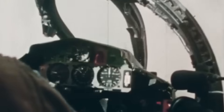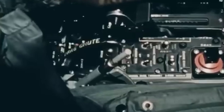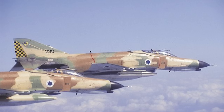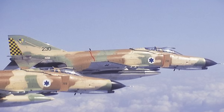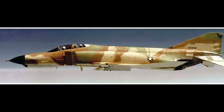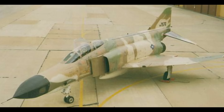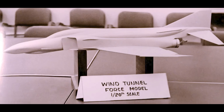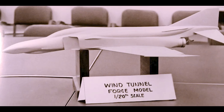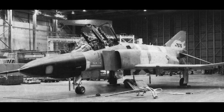With the State Department now reassured that the Peace Jack program wasn't going to turn into a high-performance interceptor, General Dynamics secured permission to test the RF-4X concept on an Israeli Phantom. An Israeli Air Force F-4E was flown to the General Dynamics Fort Worth plant in late 1974, where it underwent months of extensive testing and modifications. The program did, however, encounter some problems. After extensive experimentation, it was found that the water-methanol injection method would eventually cause the turbine compressor blades to expand due to increased heat, hit the casing of the engine, and tear it apart internally. To remedy this, designers would need more time to build and install stronger compressor blades.